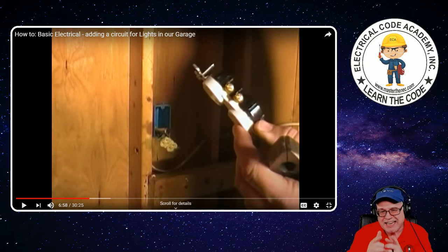Now if it had been a 15-amp rated circuit, then the receptacle could not be rated greater than 15 amperes. But since it's a 20-amp circuit, you are permitted to use a 15- or 20-amp rated receptacle. The other thing I'll bring up — they're backwiring a 12-gauge into a 15-amp rated receptacle. Typically that's a no-no. It shouldn't be allowed for you to jam 12-gauge into the back of a 15-amp rated receptacle — you would have to go to the terminal lugs on the side. If it's a 15-amp rated receptacle and you're going to backwire it, it would generally be 14-gauge. So check your listing of the device. Yes, it is okay to have a 20-amp circuit that's 12-gauge NMB using 15-amp rated devices — that's in 210.21B3.